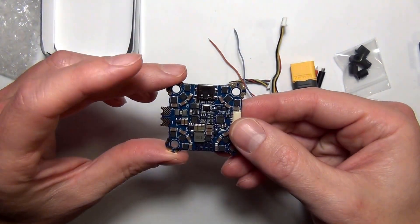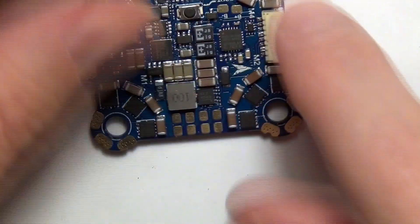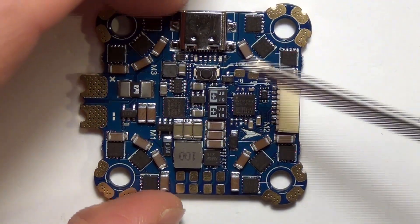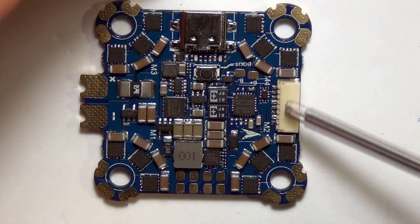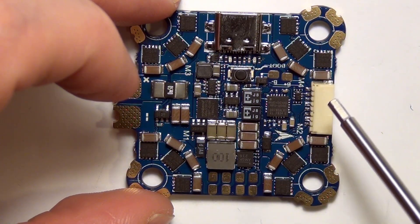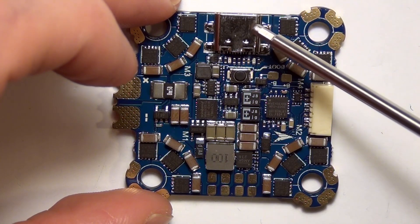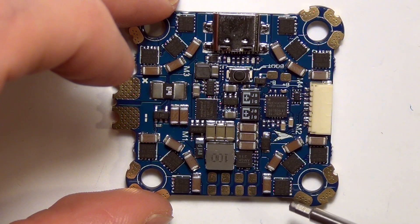And then the flight control board itself — this is an F4 flight controller with an MPU 6000 gyro. If I flip it over, the gyro is right here. This has BL-Heli 32-bit ESCs and here are the FETs for those. You can see plenty of capacitance. Here is your primary port for connecting all kinds of things. There are also solder pads to connect. Between this pin header and these solder pads, that takes care of all your connectors. It has a USB-C connector, 8 meg of onboard flash, and these are 40-amp, 50-amp burst ESCs.